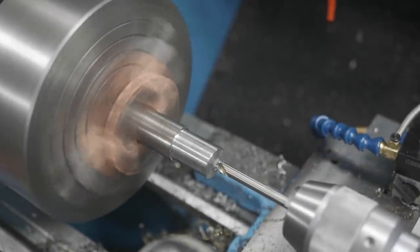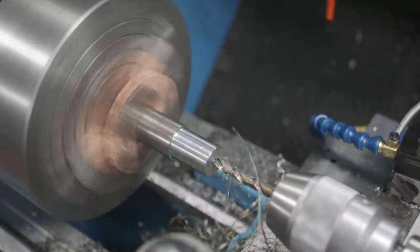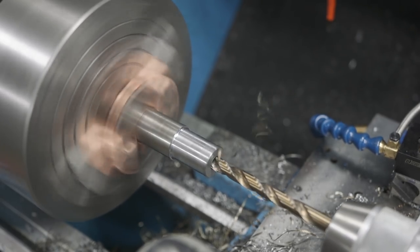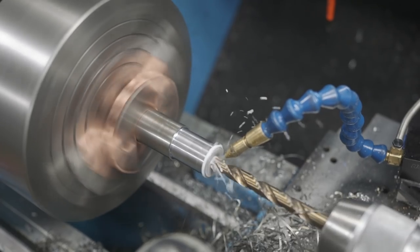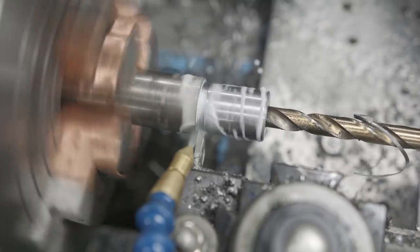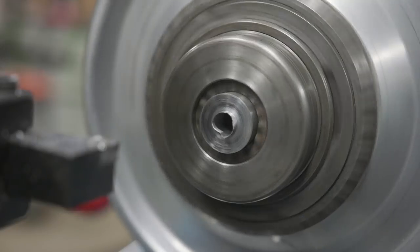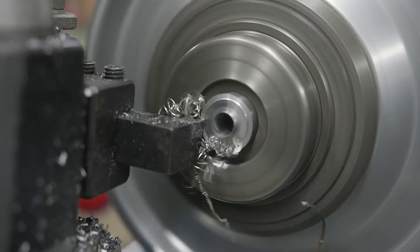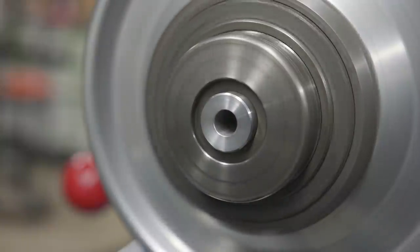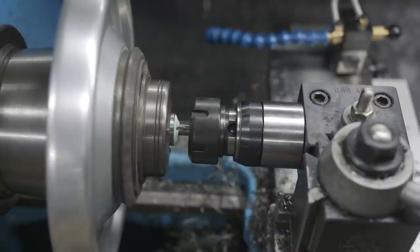We've got this one inch piece of steel chucked up in the four-jaw. We're going to be using this to make the bung on the side for the handle to screw into. We started by getting that spotted and then drilled with the drill bit — I believe it's also a 5/16 for the pilot — and then moving up to a 27/64, which is the drill size for the half-13 tap. Then we'll get the hole tapped and get it parted off. We've got this chucked up in the Jacobs Rubber Flex Collet. I really enjoy this collet chuck — it keeps things nice and precise and allows you to work really close to the collet without any spinning chuck jaws in your way. I'm using a Mari tool floating tap head. My tap is a little dull so it keeps spinning in the collet, but this did end up working out alright.